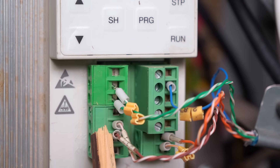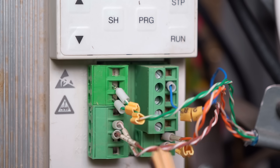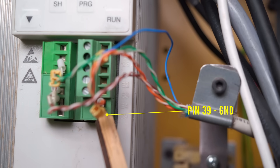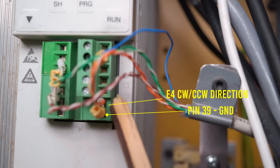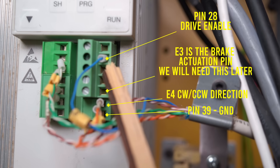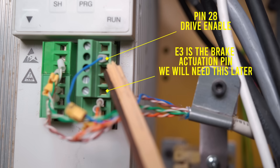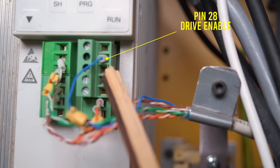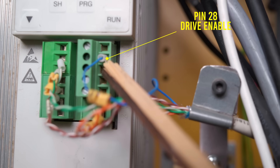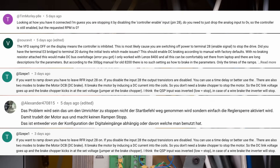The next pair of wires is an output signal — basically just a relay inside the VFD — which I'm using to monitor whether the VFD is running. On the other side I've got three more pins connected: one is just a ground, pin E4 reverses direction, and pin 28 on this blue wire is the drive enable pin. Back when I was setting up the VFD, because I didn't know how to deal with the braking going into overcurrent, I was using this as spindle on/off instead of enable. A bunch of you worked out immediately that was the problem because the display goes to off as soon as I stop the spindle.